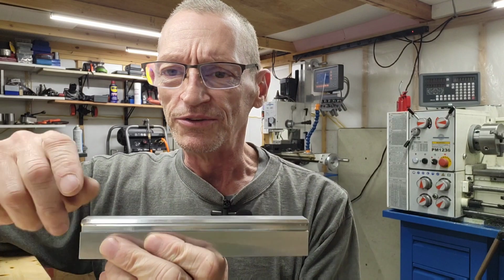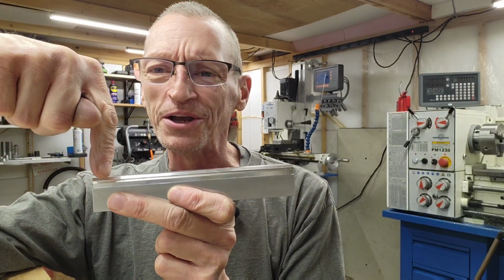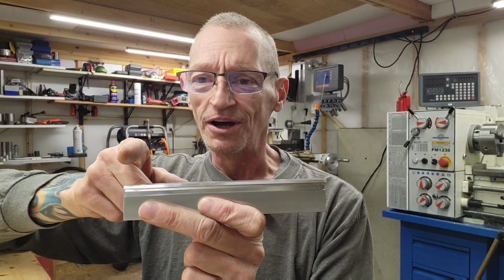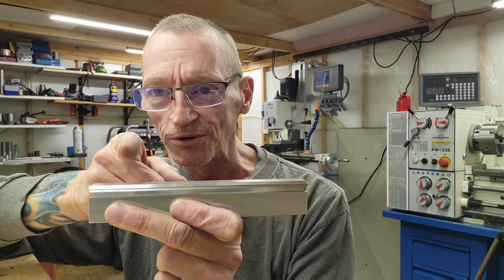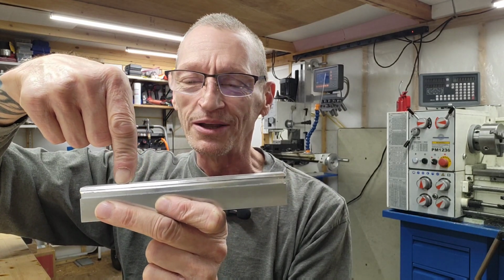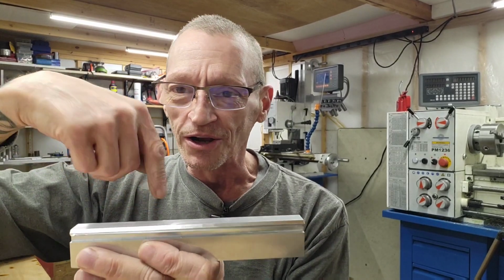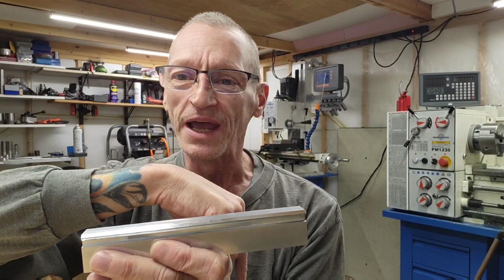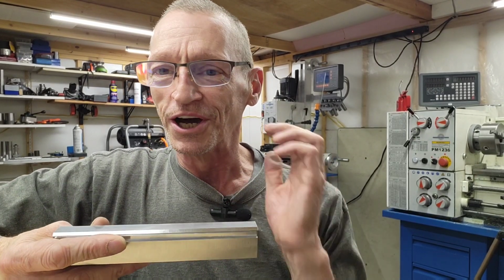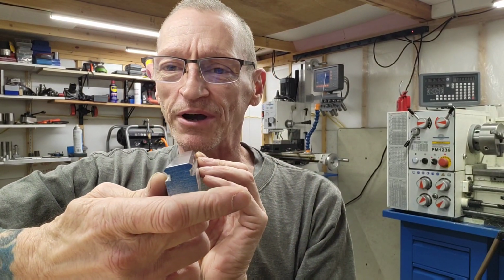Picatinny. There you go. Everything we didn't do is put the recoil slots in. There's nothing to that. It's just taking an end mill, getting the specific depth, and cutting straight slots from center to center. It's a specific dimension from center to center of each slot. So you will cut a slot, move your end mill a specific distance, and then cut another slot center to center, and just do that all the way down. It's real easy to do. You're not really going to learn anything from it. It's just literally cutting slots a specific distance apart. But there we go. We got the handrail done.